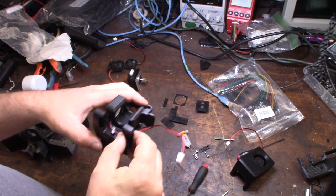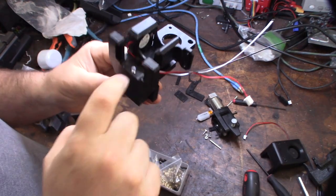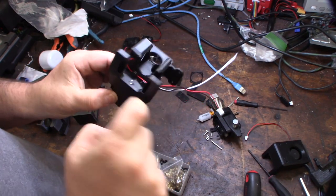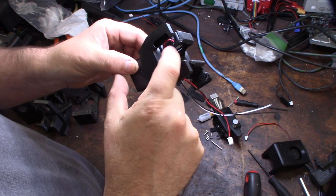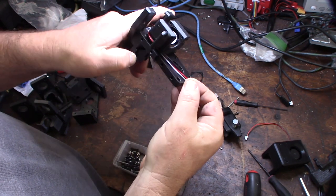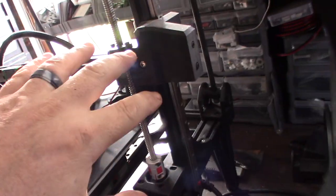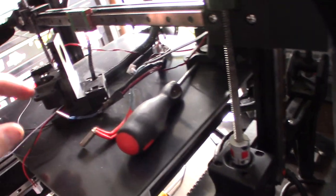Now I'm getting it onto the linear rail and fishing the wires through — you have to do that before putting the system back on. The LED wire wraps back around and exits through a hole here, with a wire screw to keep things in place so wires don't hit the hot end. The belt is held by M3 screws; get the belt on before mounting on the rail since it's a tight fit by design.